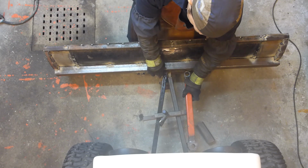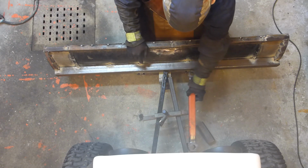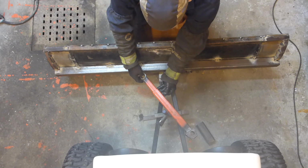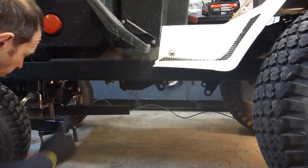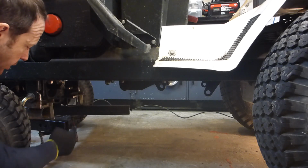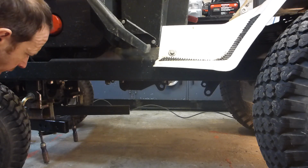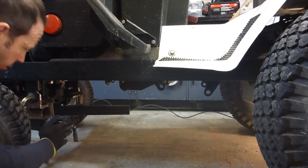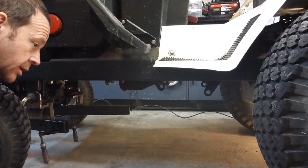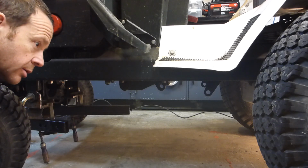Once I have this welded on the bracket, I'll be able to tilt and angle the blade as I want, and figure the correct distance on this. The idea would be to see if there's any advantage to such a cross pattern. Okay, I have the setup for the A. I put a 2x2 block under this 1x2, which gives me just enough clearance not to get stuck in the snow. I might avoid a cross member at that A, just to make sure I don't have any dragging effect in the snow, even though I don't expect to drive in deep snow with that small tractor. It's only two-wheel drive.